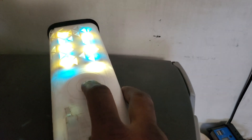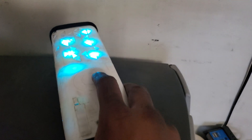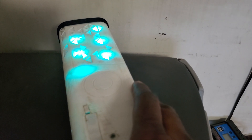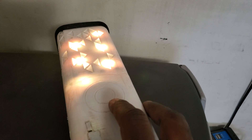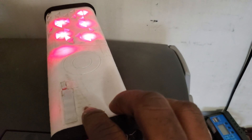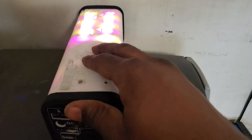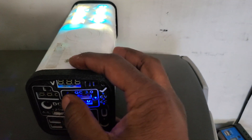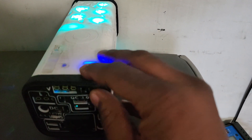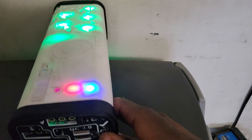I ordered the incorrect wireless charger circuit — it's a higher speed than the original 5-volt one. It actually takes 9 volts, but I had to relocate it and push it back a little. So with that I had to move back this design and also relocate these two holes at the front. The advantage of that is that I wired it to a separate circuit, so this no longer needs to be on for the wireless charger to work.